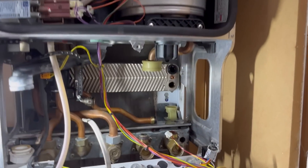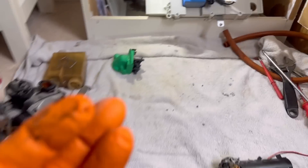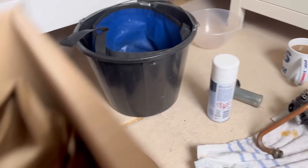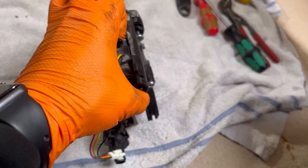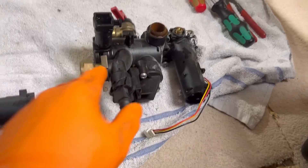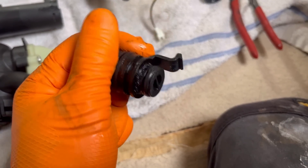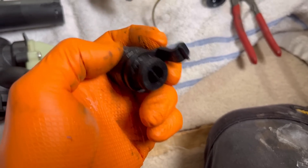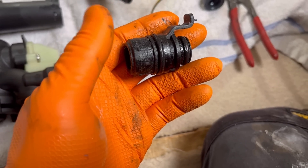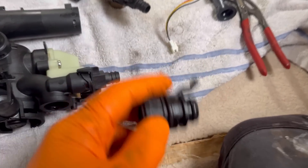Now you can see why they're a bit daunting. But once you've got this far it's usually plain sailing on the way back. Make sure you change all your o-rings that they've sent. On this I'm going to check what the turbine adapter is like because I changed this less than 12 months ago. This is a flow switch though - it's behind this. I'm going to need the return union off the old one to go in the new one. It seems in alright condition, the nut has started to go a bit perished as they do, but I took it off and gave it a squeeze and it didn't seem brittle, so I'll put that back in - I know they're only about six quid but I haven't got one.